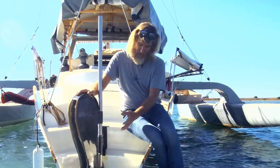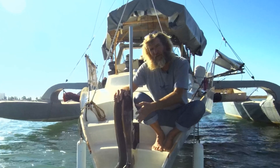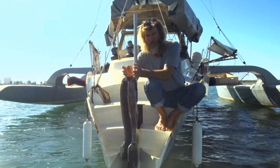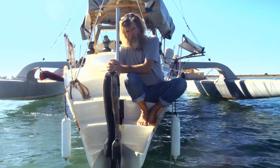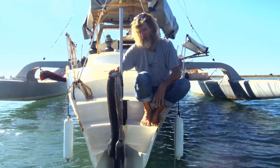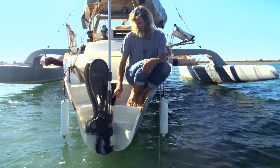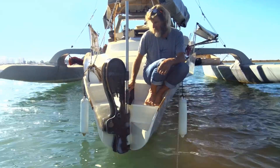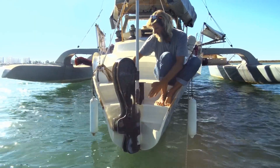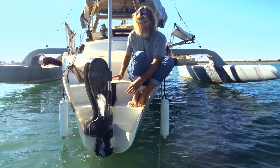That's the plan, so it's going to be quite interesting. On top of all this, the blade in here can kick backwards. I was busy building a trim flap in that blade so we could make a simple wind steering system, but the modern ones with the pendulum rudder work much more powerfully, and I'm thinking about playing with pendulum rudders as well, because I'd love to just sail the ocean using the wind to take direction and not using any electronics. Let's take this apart because this glue is obviously not strong enough — the same as the bottom, we're going to take this board out, put more carbon fiber around this, and then it all comes back in. It becomes a triangle from the top with those two extra bulkheads.